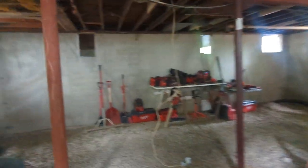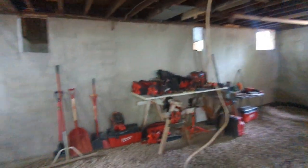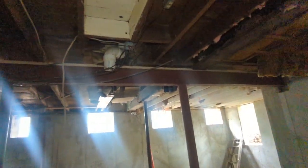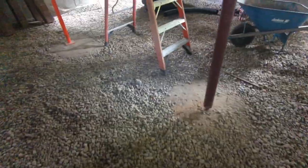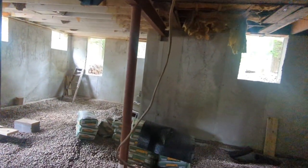because it's where you would frame a house when it was new, you would get this correct, and then you add systems. I'm not going to come in here and start adding plumbing and electrical systems to framing that's questionable, because then they're laced all throughout it, and you couldn't easily make these repairs. Not to mention trying to get lumber in and out of here, or set up and work down in what used to be here. That wasn't possible before, but it is now. So that's the tack we're going to have, and try to open things up here and get ready to rebuild the systems down here.